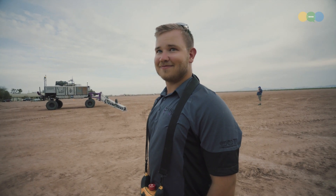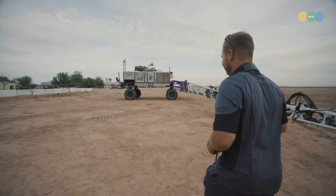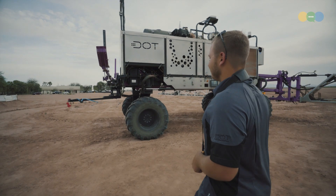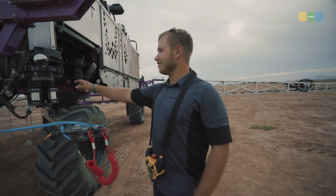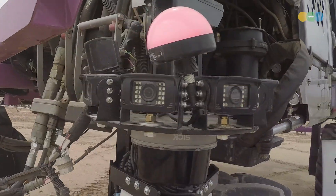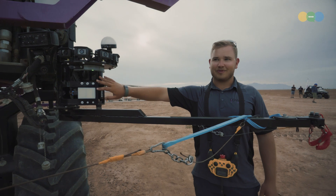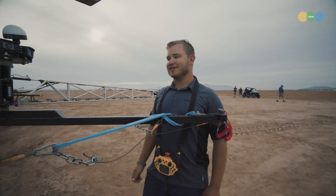So show me what's what — how does Dot see the world, Tim? On the front up here, we have the eyes of Dot. There are a bunch of cameras mounted that will give you a full view of the machine forward and sideways. These cameras will detect objects as well as display video of what is happening in the field while the machine is operating. Below that, we have LiDAR and radar for object detection, and they'll be able to measure distances from objects in the field.